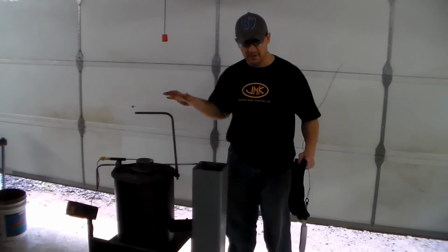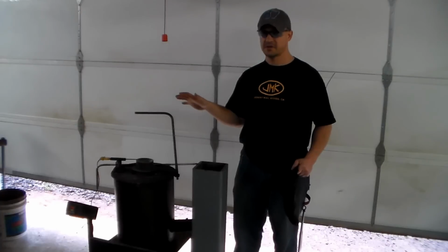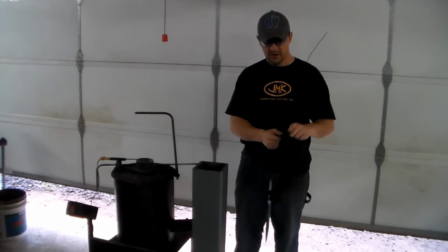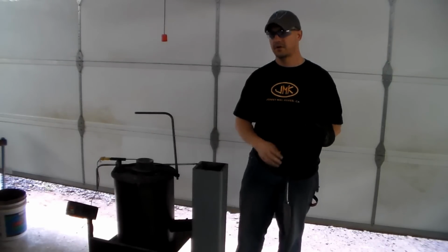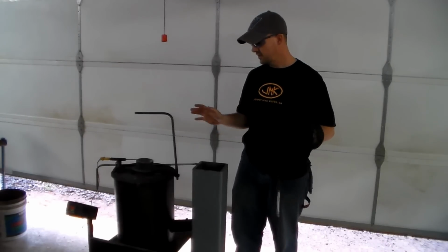Okay, so I talked about the salt bath in the first part. We've got it running now at the target temperature, 1475 Fahrenheit, and the blades are all rough ground and ready to go into the last high heat phase of hardening. And so they're clean, they're dry, they're ready to go in.